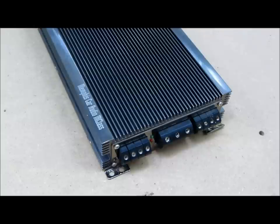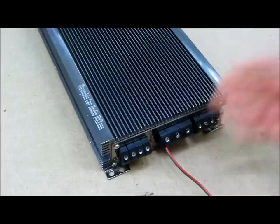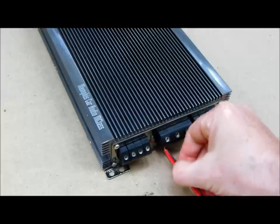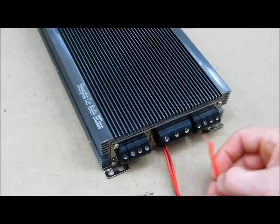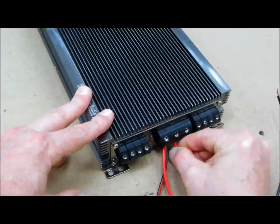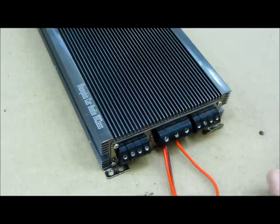I'm going to put in the power wires — just sticking them in there. 12-volt plus is the constant 12 volts, and I have a small jumper wire which I'm going to tie into my main power. I'm going to double the wire up because the holes are a little bit large. My amplifier says REM for remote — yours might say plus, turn on, or remote depending on your model. Then of course your ground.